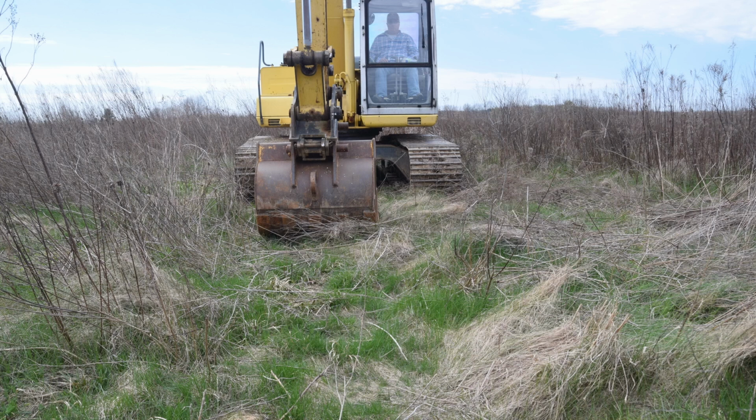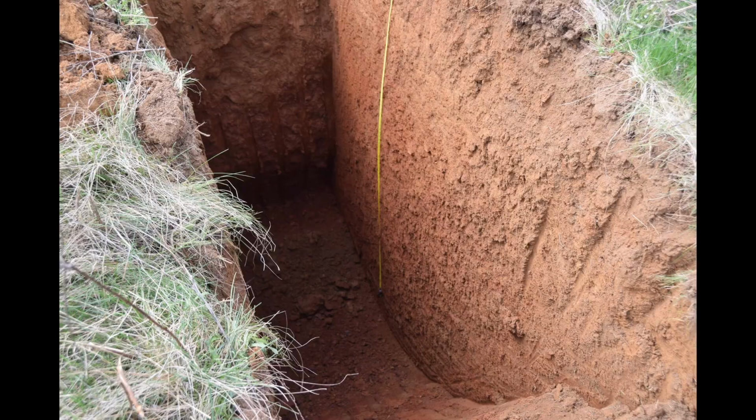John Otterback used his excavator to dig a deep test hole in the center of the area that we marked for building the wetland. We found that the topsoil layer was 8 inches thick with clay loam extending down 5 feet below the topsoil. I could make a thin ribbon that was 2 inches long from the clay loam texture soil. We found sandy loam soil beneath the clay loam. We were not able to dig down to bedrock, and no groundwater entered the hole.